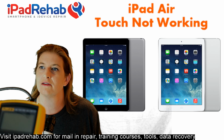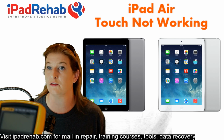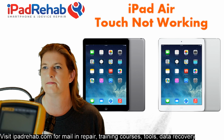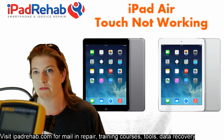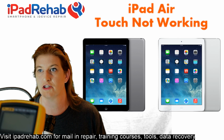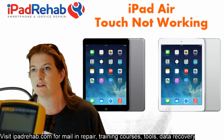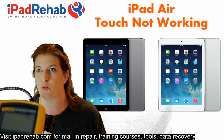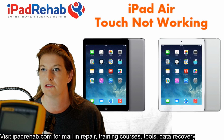1V8, ooh, it is going to be on this side. 1V8 SW2, nope, is the one that's on the bottom of the board. And then PP1V8 SW1 is over there. Let's see, maybe SW1 is the, I don't know, where does that go? We can go on a hunt to see where that is and see if it's relevant to our problem. All right, so C8136 is something we could measure, so that's good to know. C8136 is on PP1V8 SW1. So that, I think, is not our guy, but let's find out. Let's just research. Why not?